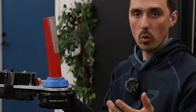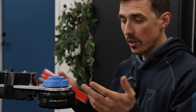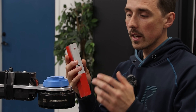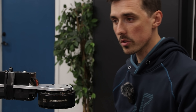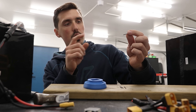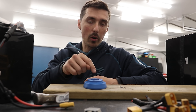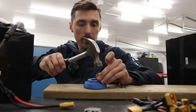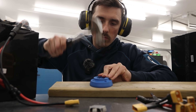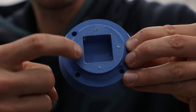In a crash, this part wouldn't be able to withstand the entire weight of the drone, so you reinforce the heck out of it. Here's a pretty sleek trick to reinforce your 3D prints — hopefully it works or I will look like a dumbass pretty quick. You take a small piece of 2mm piano wire and you hammer it into the part the entire depth of the component, and that really works. We'll do the same thing on the other three pre-drilled holes.